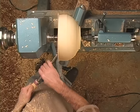In this case, I'm going to spin the lathe in the forward motion, and my drill is going to be counteracting that motion. So I'm going to use the right side of the disc only, about 50% of the disc to the right-hand side, and I'll work from the center to the outer rim. Center to the outer rim, and I'm constantly counteracting the spin of the lathe. Now, one way to know if you're going in the wrong direction is if your drill over-accelerates. That means you're not going in the right direction, okay?